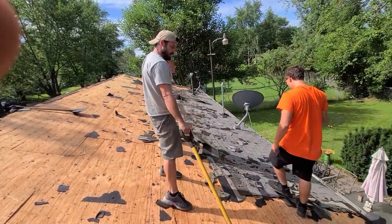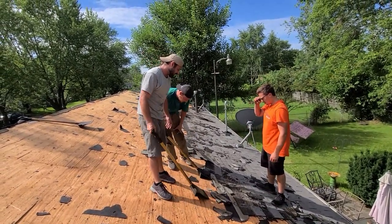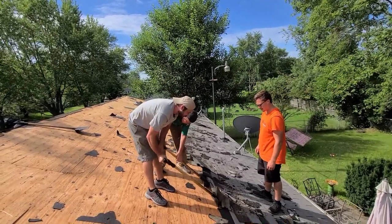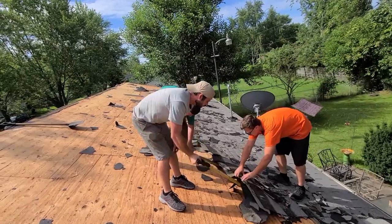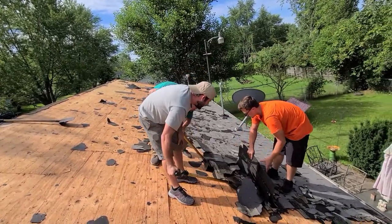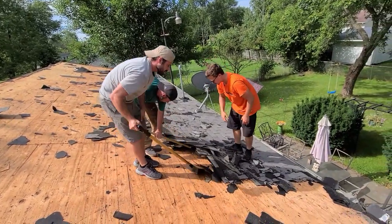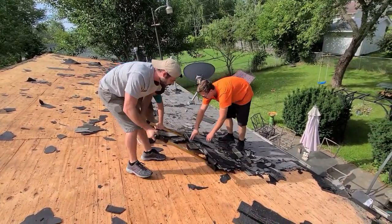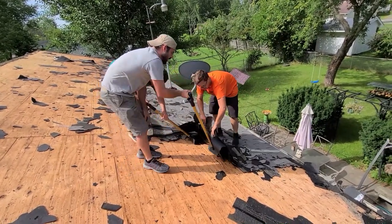Naturally as we go. It's just coming up so good. And I'll show you guys later that we don't have to change the wood because these nails are actually sticking. These other nails, they don't have to barb them or anything like the coil nails do. But our shingles will be just fine. One plug pull out. Gotta watch out for the plywood seams. Don't tear them up.